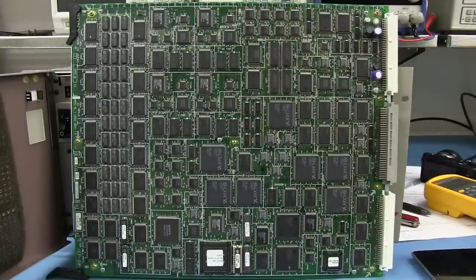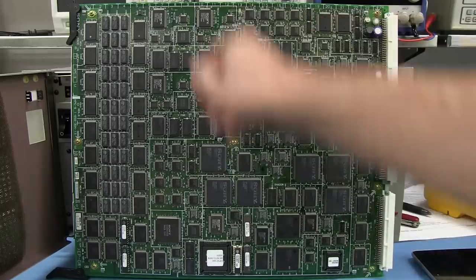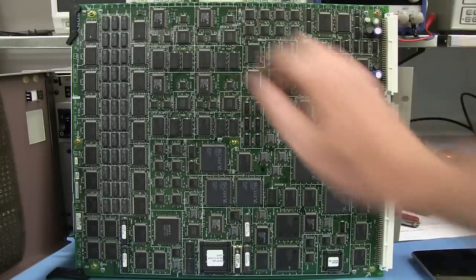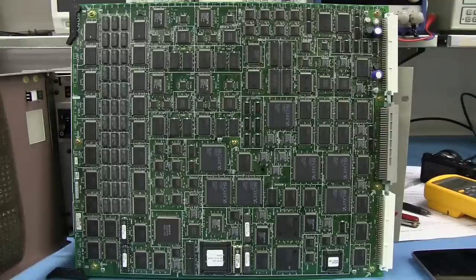it's all digital, you could actually auto-route something like this, but not complete auto-routing. You might auto-route some sections. Like all this memory stuff over here, you might let it route those after you've placed them and maybe done some pre-selective routing around here, trial routing to see that it actually does what you want. Then you'd copy it and let it rip on the whole lot.